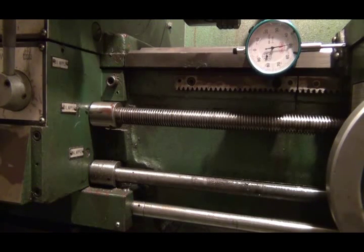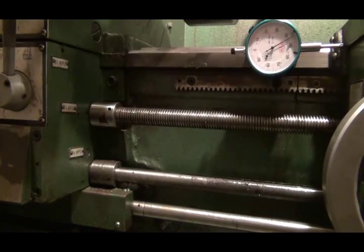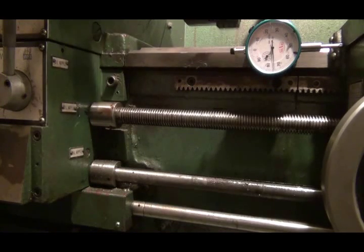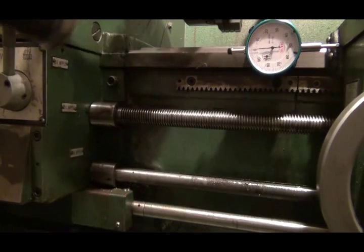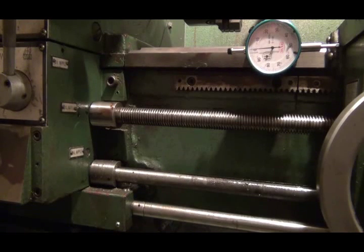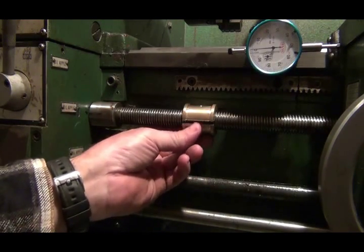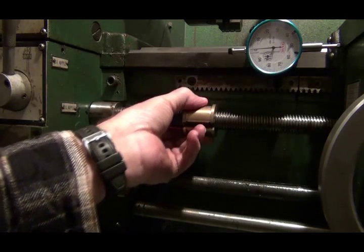1, 2, looks like it's 2.5, which would be 1/4 inch. Four moved it 1/2 inch, which figures because it's 8 threads per inch. Paul's was 4 threads per inch. Let's check the other things he did. Be right back. I do have a new set of the half nuts, and they lock in there just fine.